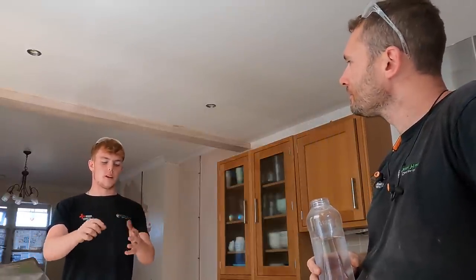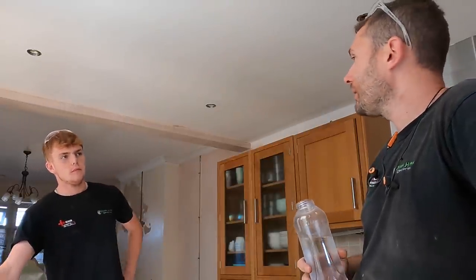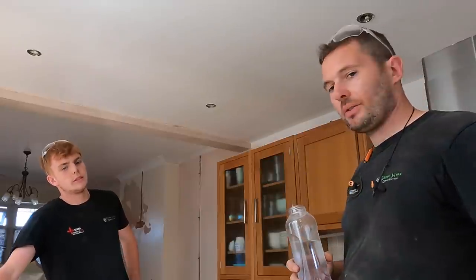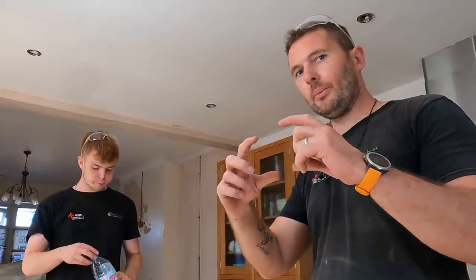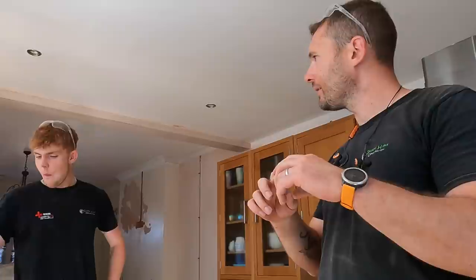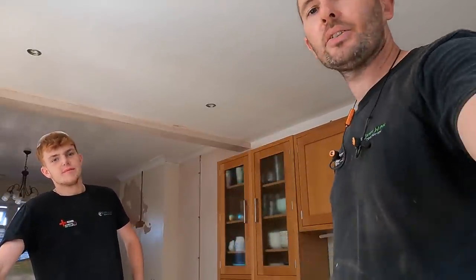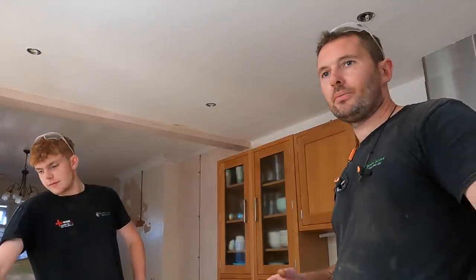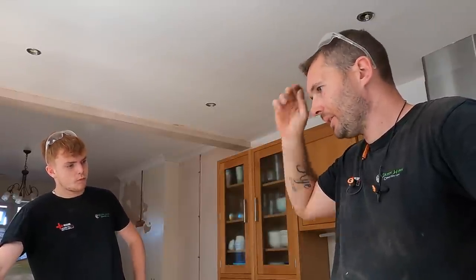When you're setting out for sockets and stuff, and you're drawing it all out, make the line longer. It's easier to see. Because it's all being decorated over, so it doesn't matter. And it's easier for chasing, isn't it? Because when you don't do that, and you just draw around the back box, how quick does it just disappear? With the plaster falling off, especially here, it just falls off. So it's a right pain. I'm glad you've taken that on board, because it's just a tiny little tip, but it does make a big difference.